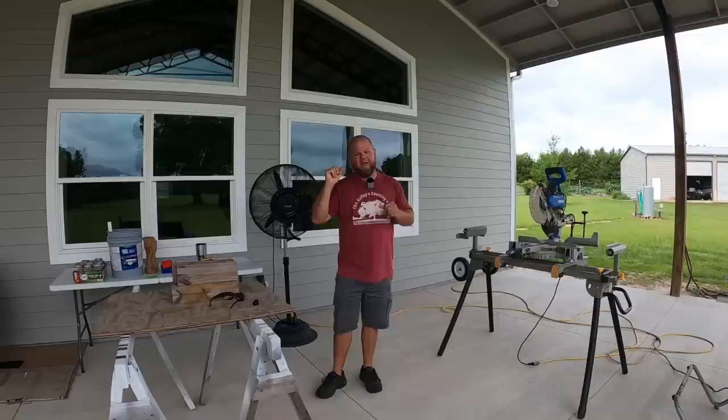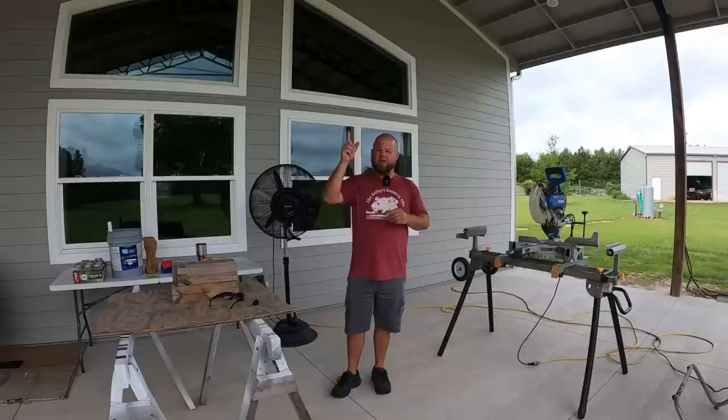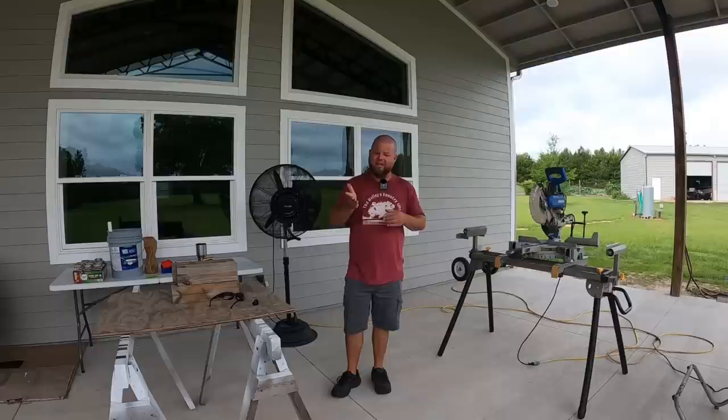So I have a pole barn that I built that's only about 2 years old, and I'm already starting to get drilled holes in a lot of the 2x6 purlins. That's an issue. It has to support the roof, and what if I need to get up there to do repairs or walk around in the future? I don't need a single board with a bunch of drilled holes in it losing its structural integrity.